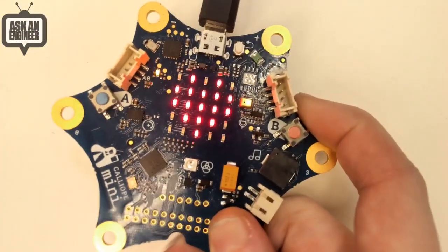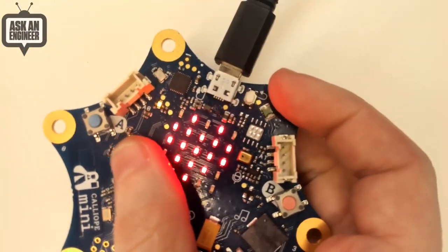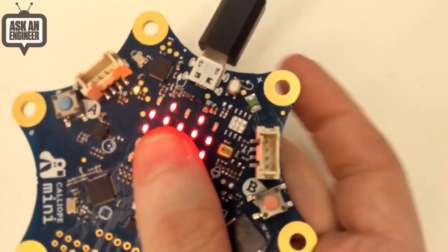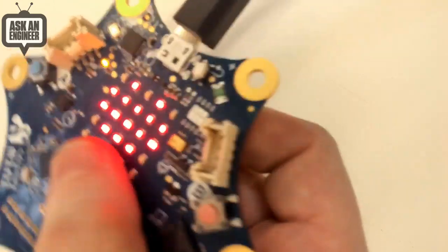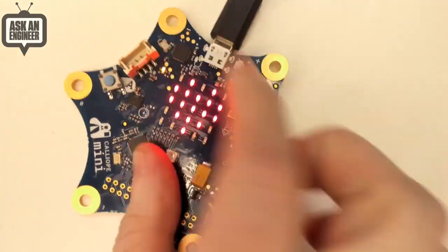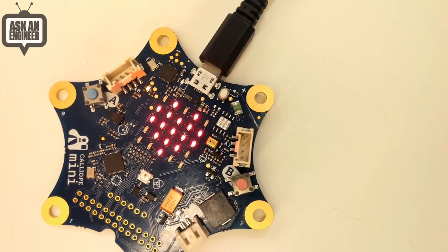You would use the Microbit definition, and then you would just treat all the hardware as if it was connected to Microbit pins. You can also use a version of MakeCode for the Calliope. They have calliope.makecode.com or something. And it's available, and it has blocks for all the little built-in add-ons like the microphone and the piezo beeper.